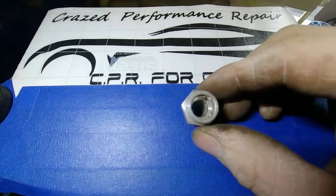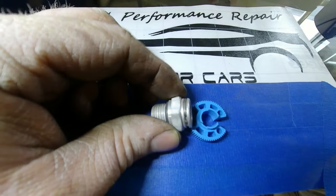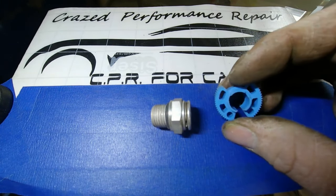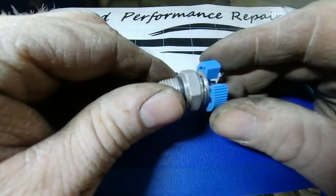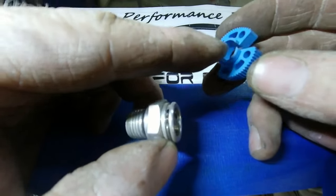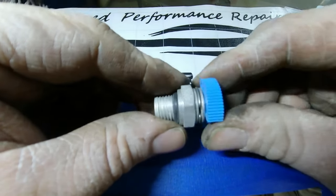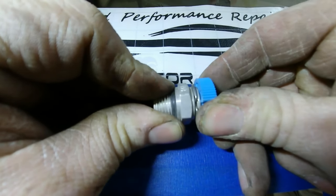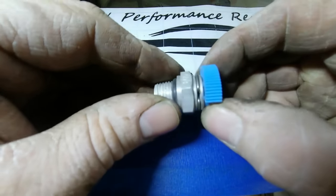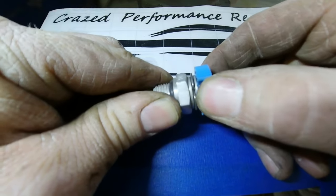If you have one of these connectors, this is a transmission or engine cooler line style connector. It has a special tool — normally the tool is metal if you buy the good one. You see those little three pieces holding the barb on the line — the tool slots match up with those. You put this in, turn it until it falls into place, and then when you turn it, watch the wire: it raises up and drops down, pushing those little ears outward to release the line. That's the proper way to do it — there's a metal version linked in the description.